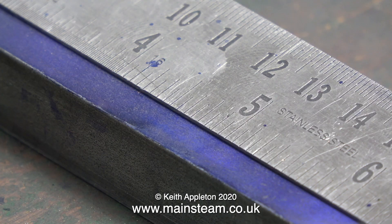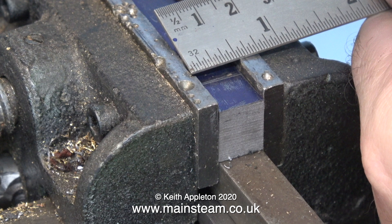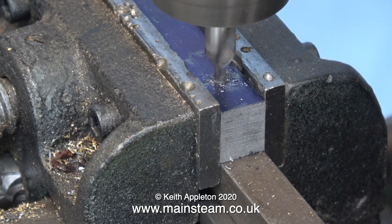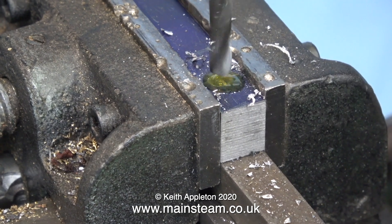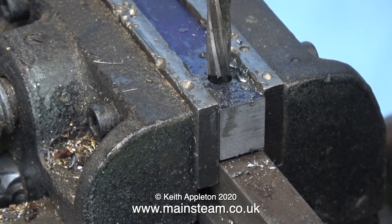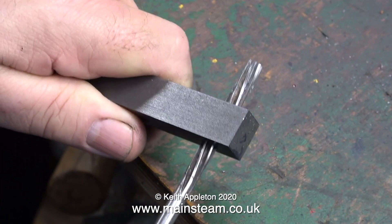I have quite a few operations to do to this piece of steel before I mill the slot. In the next episode you will see why it is important to get the sequential order right. The first part of the job has to be drilling the holes for the bushes. I'm not going to show this at great length because I've already shown it in part 28. The only essential difference is this time I'm going to drill through the right side of the piece of metal — the metal bar is not square, it's five-eighths by half an inch. I'm drilling the half-inch side first with the center drill, making sure it's exactly on the mark, followed by a twist drill which is one imperial drill size less than quarter of an inch, then followed by reaming it with a hand reamer, but only part of the way through.